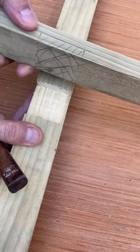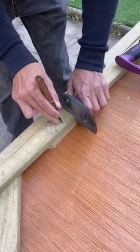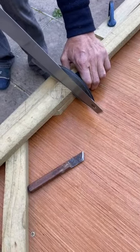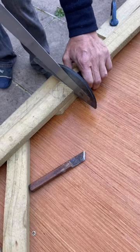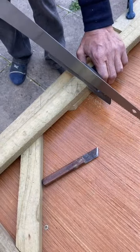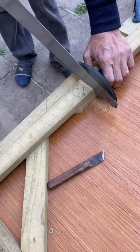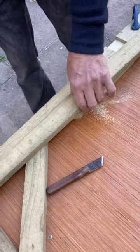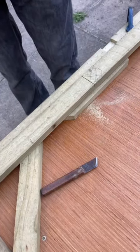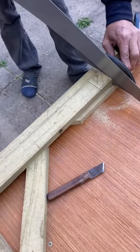They'll go together nicely and beautifully when you cut those out. To cut these out, put your knife in the knife mark — it'll give you absolutely pinpoint accuracy. Slide your Studhawk 90 up to it, make a slight downhill cut at the front to start the cut, then tilt the saw slightly backwards and go down to the correct depth on both sides. Turn the wood 180 degrees to keep your Studhawk 90 on the right side of the wood so the saw is on the waste side of the line.